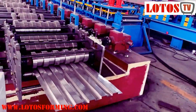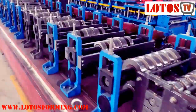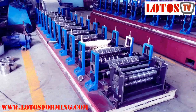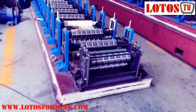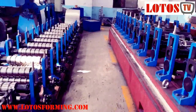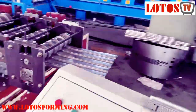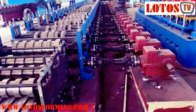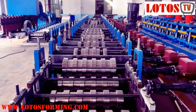There will also be a cassette design. I already took a video for my previous video and explained it to you — here is the cassette design. The roller shaft, the stands — everything is finished and well adjusted by our operators. You just need to shift the cassette: take out the screw and shift the cassette unit to achieve different profiles on one machine. Normally this approach is recommended for heavy-duty and high-cost machines, especially those with around 20 rolling stations and gearbox transmission, where the panel width or forming shape varies, and we suggest to the customer to combine them together.